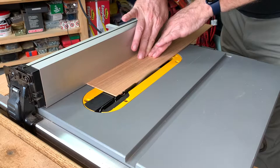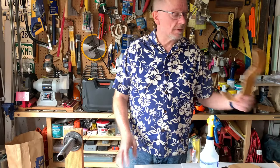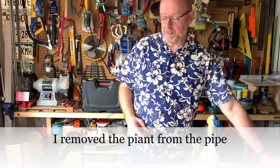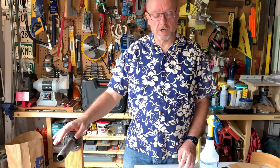Now we come to the last thing we're going to do for this episode. We're going to bend the side pieces to the shape that matches what we got off the original ukulele. So I'm going to use hot pipe bending using this hot pipe and heat it up using a heat gun so that water will sizzle off of it, so then you know it's hot enough.